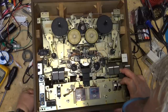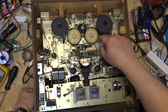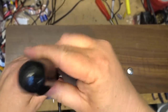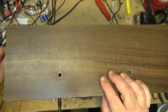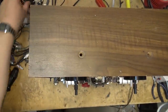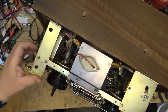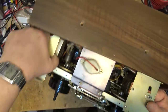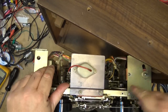Good torque on the belt. The customer that owns it has changed all this — she changed the pinch rollers, lubricated it all, changed the belts. This was all done prior to it coming to me. To remove the actual deck assembly we have to take out these long screws which attach the deck to the mech in there to the cabinet, and that should allow us to lift the deck out to work on it. The four feet on the back have to come out as well — four screws in the back first, then these ones holding it in place.